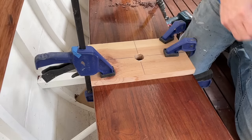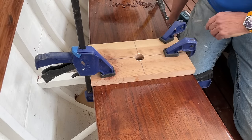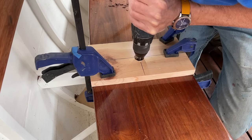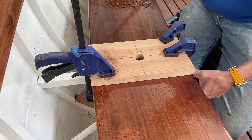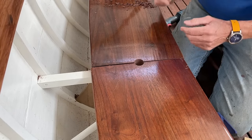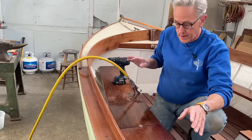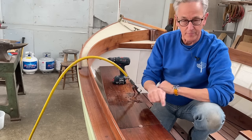Now that I've got that drilled in there, on the end of my little plug here I have a 3 and 1/8 inch tenon. So I'm going to use a 3 and 1/8 inch bit, and because the center bit has made the center in there I can find it very easily. And it looks perfect. Now that I've got that one in, I need to put a half circle on each end of these two seats. I'm going to take them out of the boat, put the aft end and the fore end together, clamp them, and do the same thing.